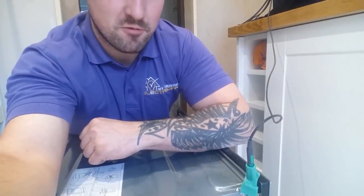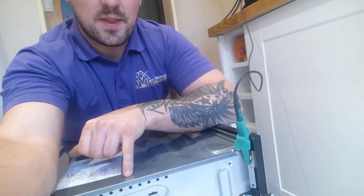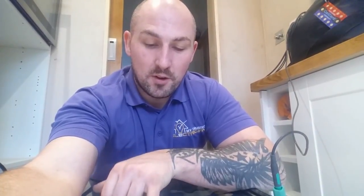These things weigh a tonne so the last thing you want to do is damage anything below - they're not cheap. If you want to replace the door, it's not like a couple of quid. I know a lot of sparks that will test an oven at the isolator because it's just way too much hassle pulling the oven out - it's grimy, full of crap, not enough room in the kitchen. But I always test the outer casing, because that's the bit the customer's touching. When the shit hits the fan, that's the bit that matters.